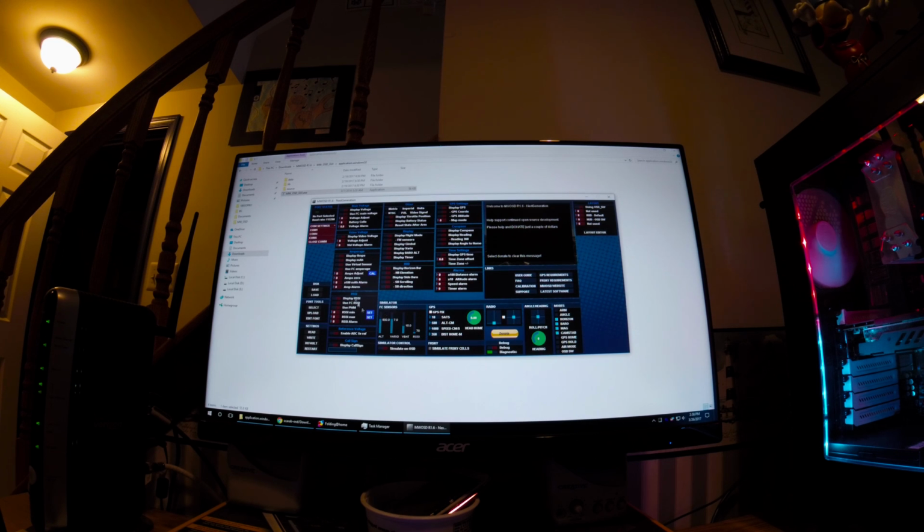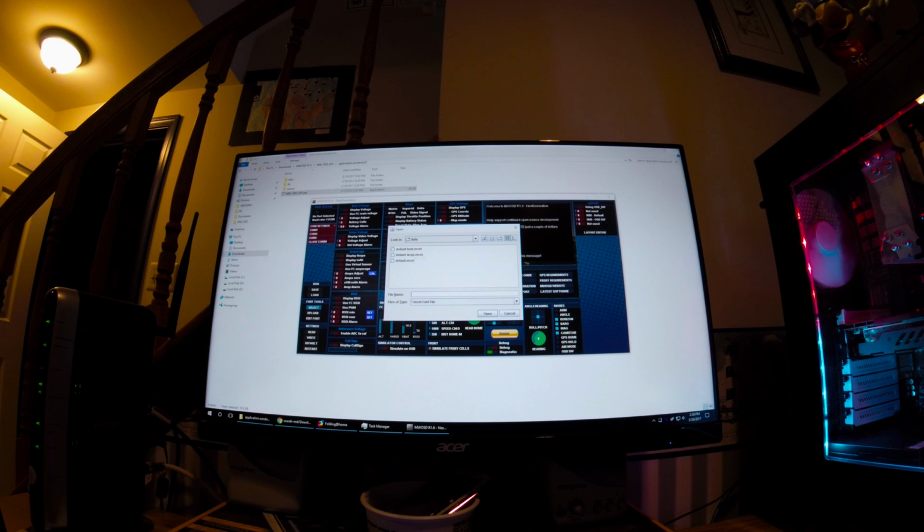Okay, so we are going to first get the font in order because we are running KISS. We still have the KISS font loaded onto this right now. So I'm going to hit select. And what you want to look for is your MultiWii OSD folder, go to the OSD, oops, hold on. Is it in the GUI? Oh, it's in the GUI. And then go to data in the GUI folder. You can pick whatever. I like bold because I can see it better. I feel like the default's too thin to really read easily, so I'm going to go with the bold font.